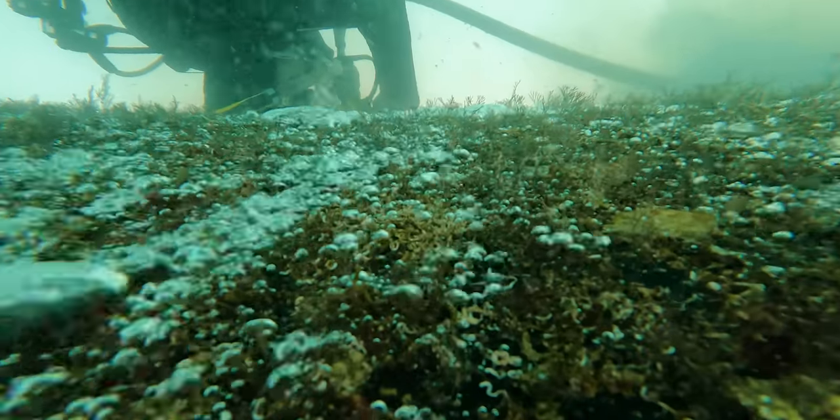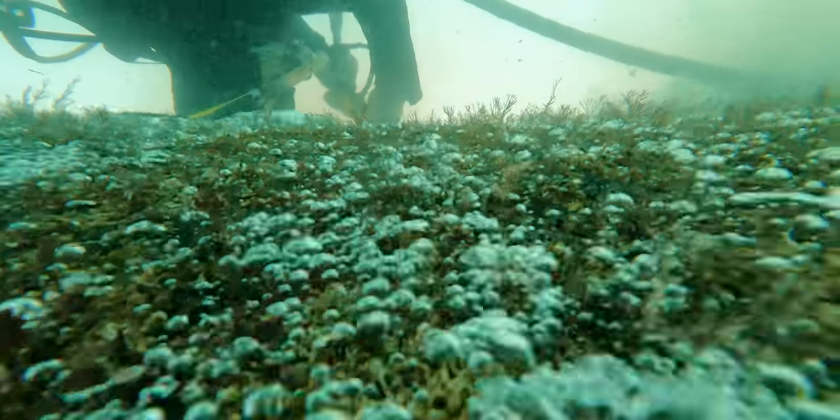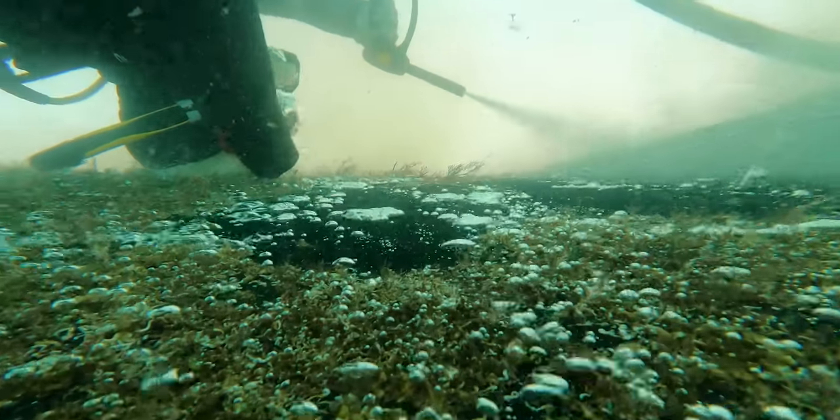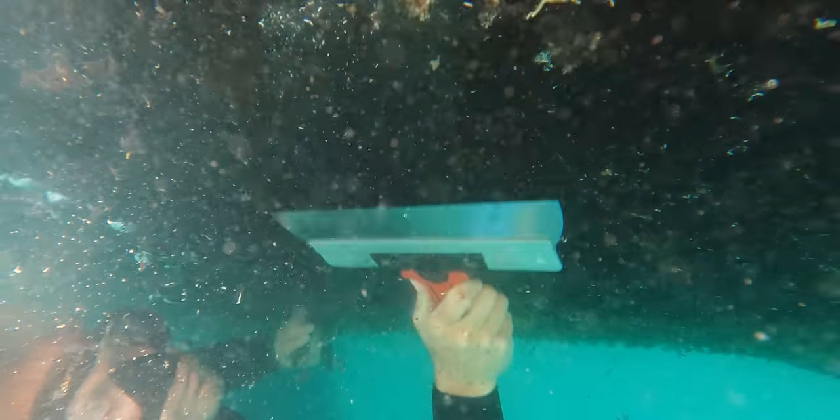No, I think we experienced the same or even less growth than we had on our copper coat. And we sailed with our copper coat for more than 3 years. It takes less time to properly clean it than the copper coat, because when you have our experience with the growth on the copper coat, you really had to push hard. And with Finsulate, it's easily removable with the spatula and the Scotch-Brite.